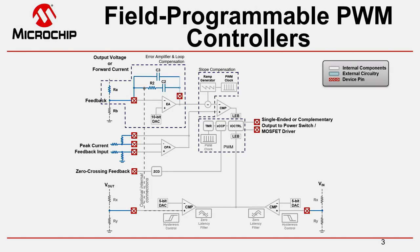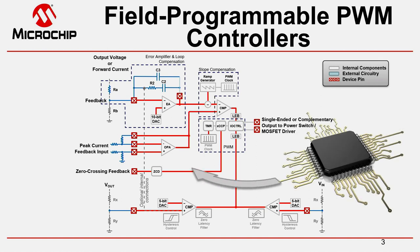When we look into typical PWM controller architectures, you usually find circuits with an error amplifier at the input, comparators, additional operational amplifiers for signal conditioning, PWM modules, slope compensation ramp generators, zero cross detectors, and additional protection circuits. In these complex circuits, the interconnects between every single component are dedicated and fixed in hardware. With field programmable PWM controllers, by adding a microcontroller, we can now alter these circuits — modifying the interconnects between different components and, during runtime, measure, control, and monitor every single one of them.